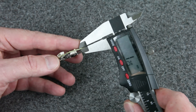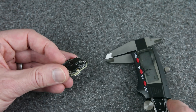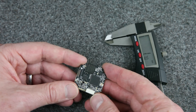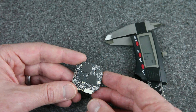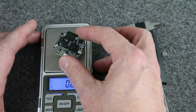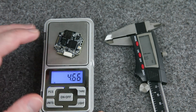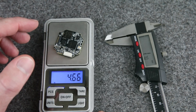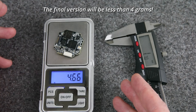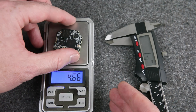The other thing that makes this different is they've made the PCB a little bit thinner — it's 1.25 millimeters thick, versus the previous 2 millimeter board. A thinner board is going to be lighter, but also more fragile — you would not want this board to flex. This video transmitter comes in at about 4.66 grams, which is about 0.8 grams lighter than the previous 2S version. Every fraction of a gram matters on a 65mm 1S whoop, so that's a big deal.